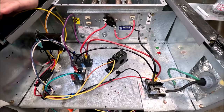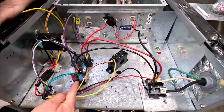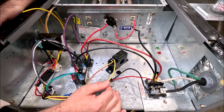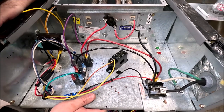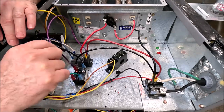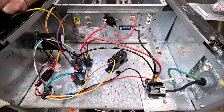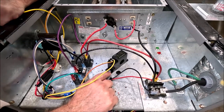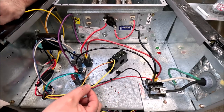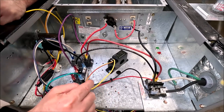Back to the air handler. What I've got here is a standard electric heat air handler. I've got a simple fan relay, a heat relay over in the corner, and I've mounted this current sensor in the midst of all the wiring. We've got a PSC fan motor using only the high speed. For the first two examples, we're going to use this current sensing switch to monitor airflow. The first example: monitoring airflow and running the low voltage Y circuit through the current sensing switch.